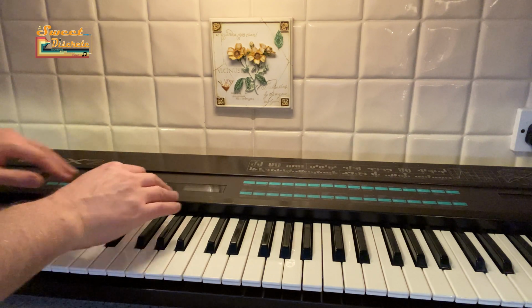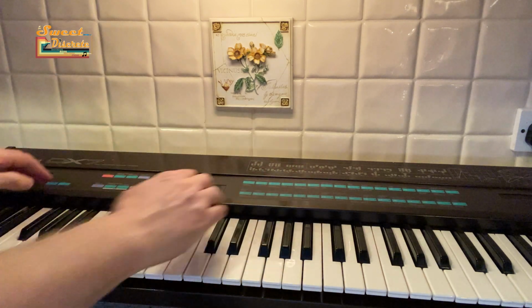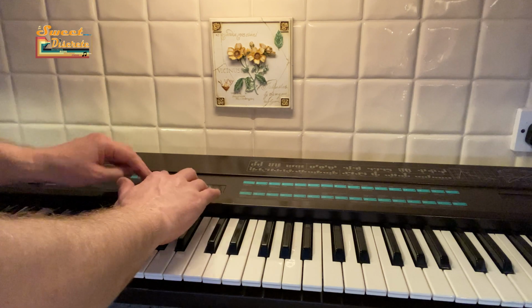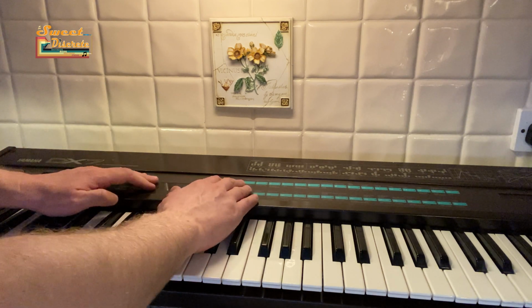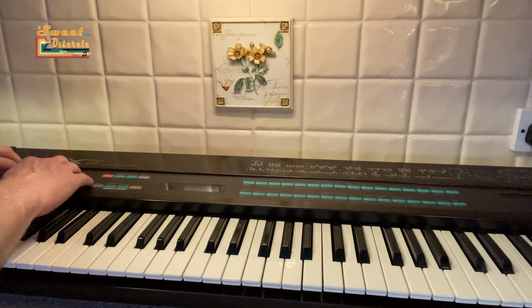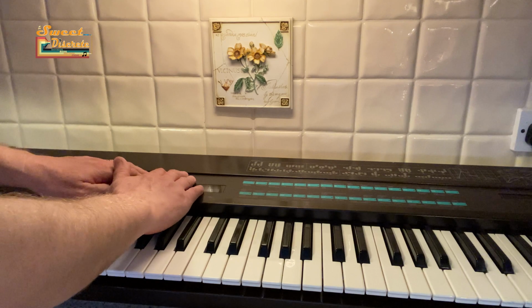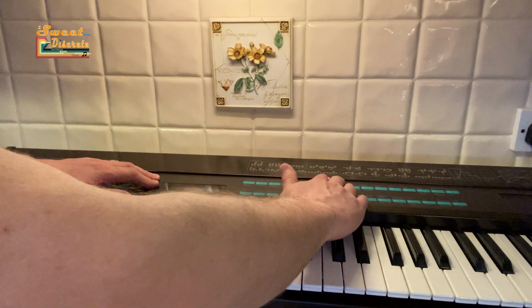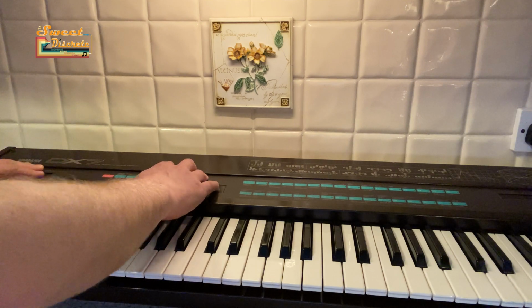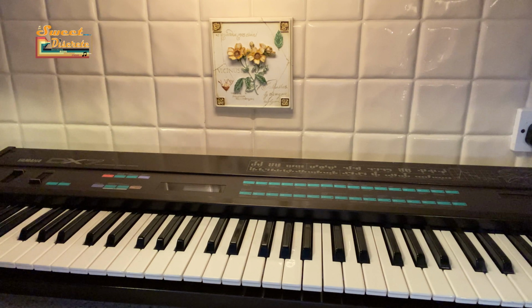Just sit. Okay, now if you bring it, there's this lip here, if you bring it so it just sits, you'll feel around the screen. You'll feel the bottom, the top, and then just visually by eye, just make sure you've got an even gap, and then check your other gaps. The panel won't be stuck down at this stage, so of course there's still a little tiny bit of give. So if you find that you're slightly out, I won't be too concerned, as long as you look neat around these.